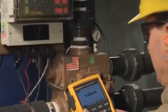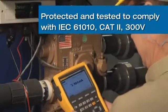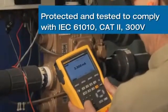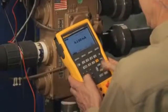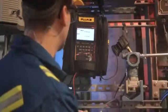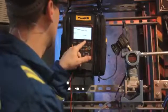The 750 series calibrators are uniquely protected and tested to comply with IEC 61010 CAT2 300 volt. What this means to you is that if you misapply either 120 or 240 volts AC, these calibrators are designed and warranted to survive and keep on working.